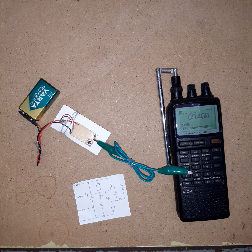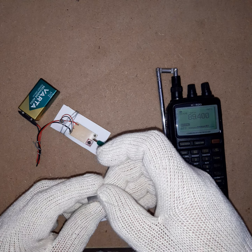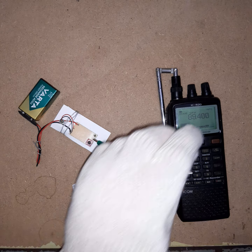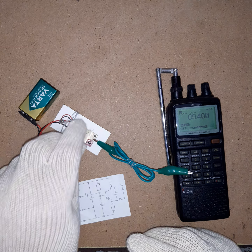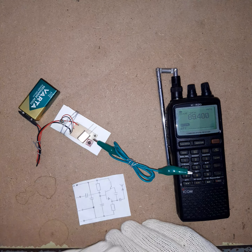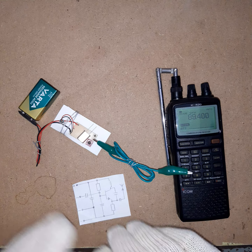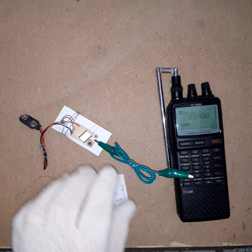If you dig through various sellers, through their websites, you will find a crystal like this. It says 100 megahertz. So 100 megahertz crystal, which is spot on in the FM dial. And you can just add a crystal and get away with all this frequency drifting, just by putting the crystal there. And it would work. Well, that is how you may think it does work,